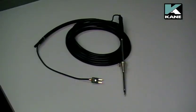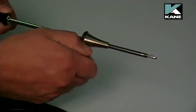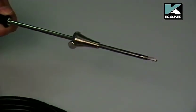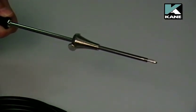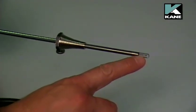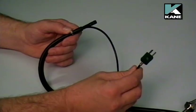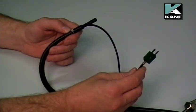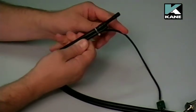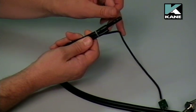This is the standard flue probe. On the shaft of the flue probe, you've got an adjustment cone so you can gauge how far you put the probe into the flue of the boiler. On the tip of the probe, you have a thermocouple — this wire — which is actually going to measure flue temperature. The cable from the thermocouple runs down the side of the hose to this plug. The actual hose itself has a connector, a black connector, with two o-ring seals.